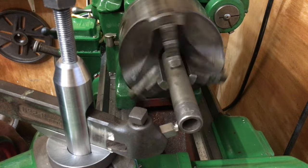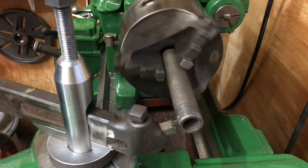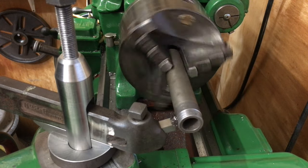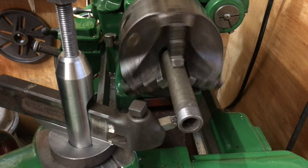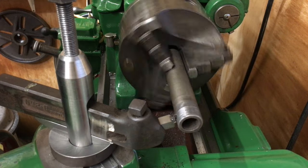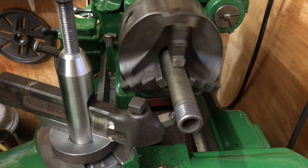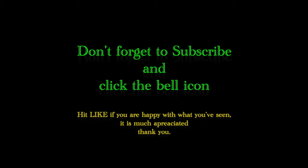As a special treat I found an old 7/16th Whitworth spanner with war department markings — this will be the spanner I use to lock this ½ inch BSF bolt into place after setting on the centre line. Just to prove it works I plunked a spare bit of tube into the three-jaw chuck and tightened it up. The feed was set to 24 thou by 20 thou deep, then another cut at 15 thou feed and 24 thou deep. The tool I used wasn't even sharpened — it was just one that was in the holder. I hope you enjoyed this video, thanks for watching.